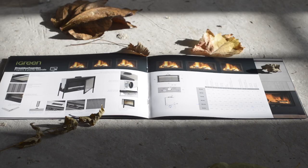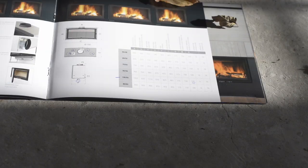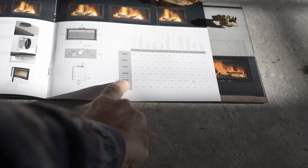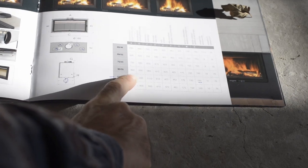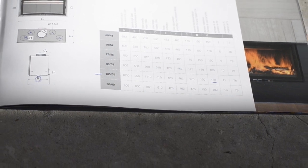The Eye Fire is actually an Eye Green fireplace which burns wood very efficiently and is very environmentally friendly. It is modular, made of cast iron, and has a swinging door — you can also get lift doors, but we went for a swinging door. All you need is an air intake and an exhaust that goes into the chimney. We decided to go for the Eye Green swinging door fireplace, 105 centimeters wide by 55 centimeters tall, with an efficiency of 76%, which is not bad for a wood stove.